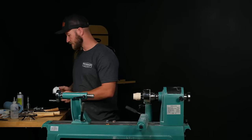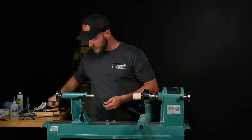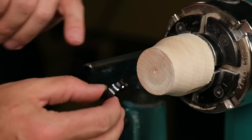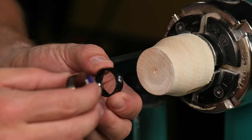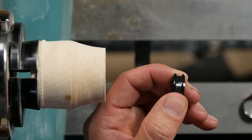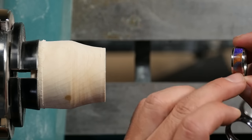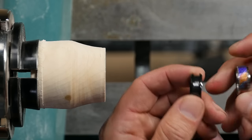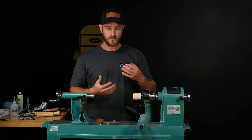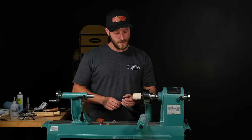What we're going to be turning today is a black ceramic inlay core, which is a really good looking core. The nice thing about these inlay cores versus the threaded two-piece is we don't have the seam, and we also have a lot thicker wall thickness of the wood when we put it in there. The two-piece cores result in a pretty thin veneer of wood by the time you turn it down, whereas with the inlay core, there's a lot more material — it's going to be a lot more durable long-term.